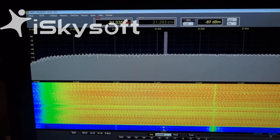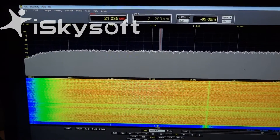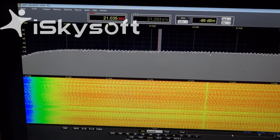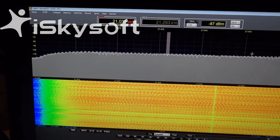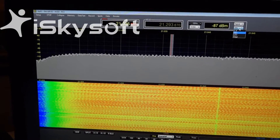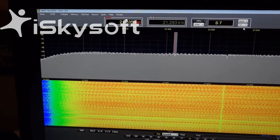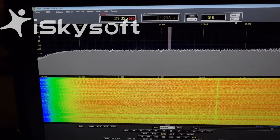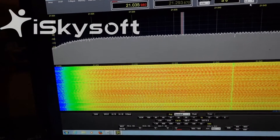This is the LP-PAN and what you can see here is our horrendous noise floor. It's about minus 83 to 86 dBm, and if we switch that to S-units — if you're not familiar with dBm — we get about an S6 to S7 noise figure here.